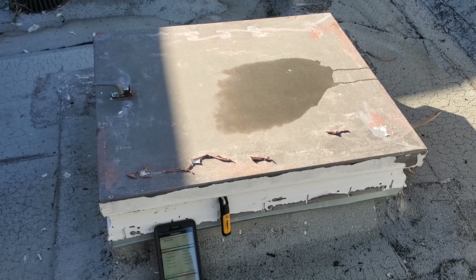That's decent for now. We may have to pull them and clean them properly, but at least we got the lint and the dust out of there. Let's open up this indoor blower assembly and see what it looks like over here. Power's off. Nice loose belt — that's not going to help the situation either. Let's go ahead and get that guy tightened up, and then we'll start it back up.